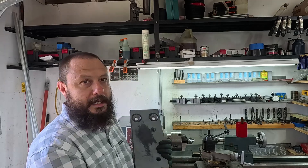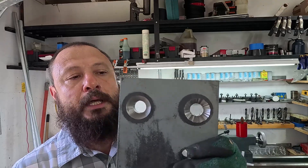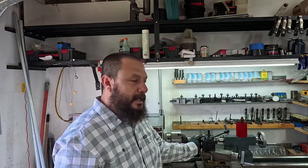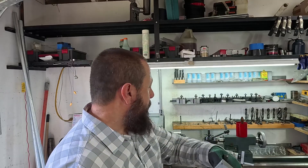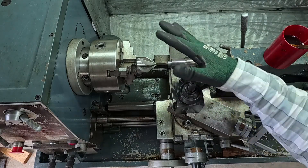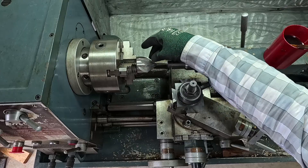This bit should be run slower than my milling machine, so I had to use my lathe. This is the difference between the milling machine bit that dulled and this one. What I ended up doing is building this adapter that goes on the tailstock — it will register on it and the tailstock will keep it in place to be able to countersink the hole. The slowest speed on my milling machine is 120 RPM; the slowest speed on my lathe is 60 RPM, making it more ideal to use this large countersink bit.